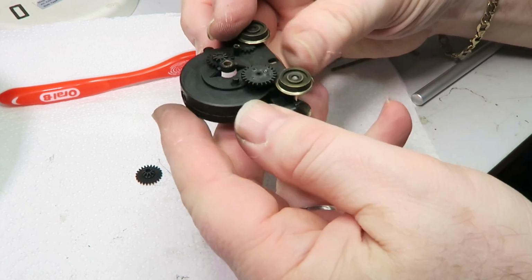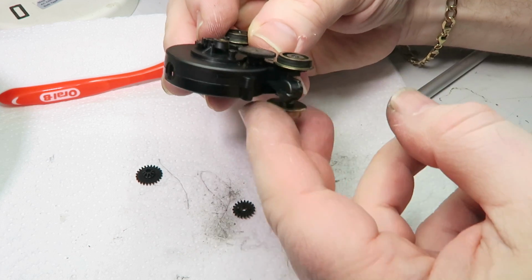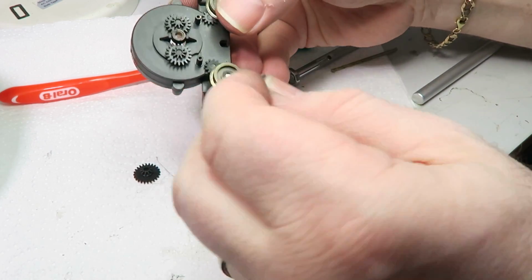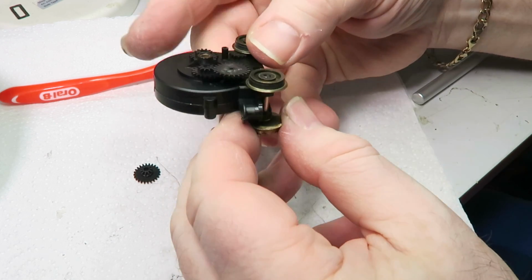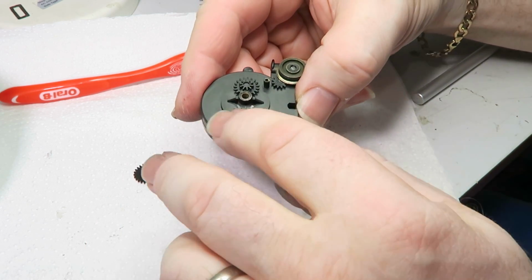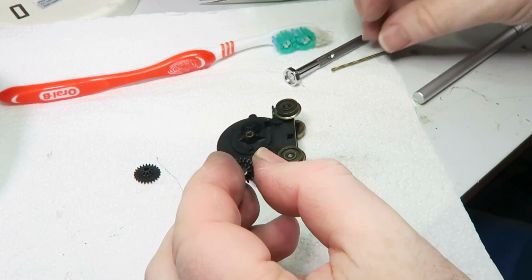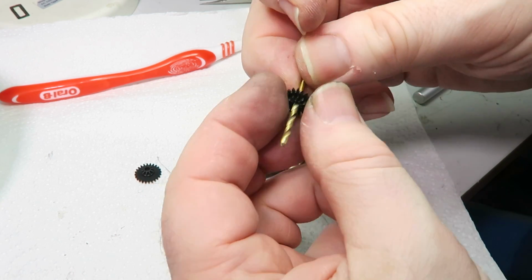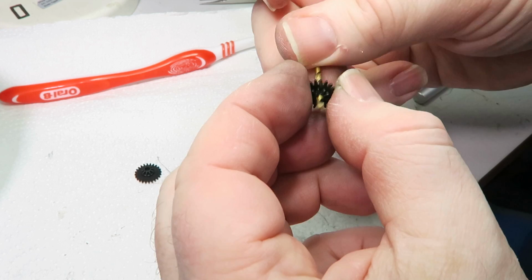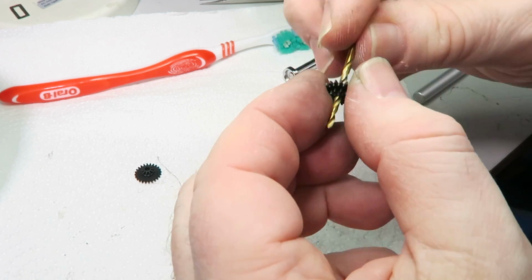Now then, in testing the gears, you see I have not put the final one on that goes to the motor. That's nice and smooth and silky, as you can see. But if I put this one on and then put this in, obviously you can't feel that when you're viewing it, but do you see how it's much stiffer? What it shows is that this one isn't moving very freely. So what we've probably got is a bit of muck inside the cog. What I use, very gently, is a drill almost the same size, and just whilst twisting it, move it around inside the cog. And if there are any little bits of flash or plastic mouldings in there, that should clear them off nicely.